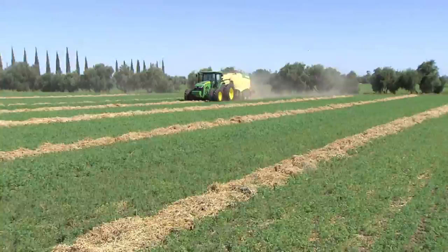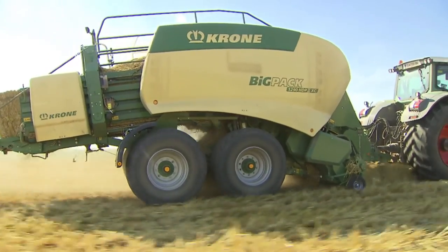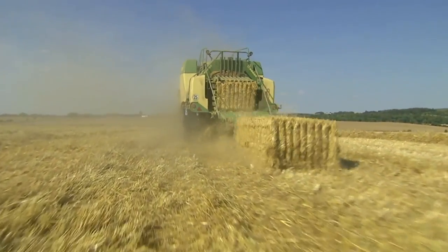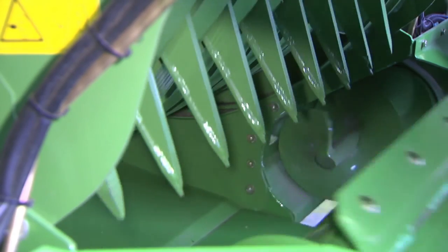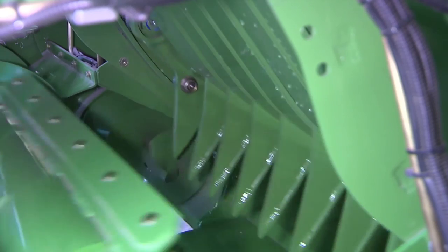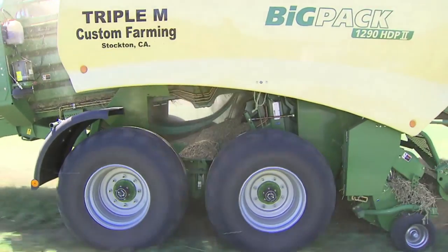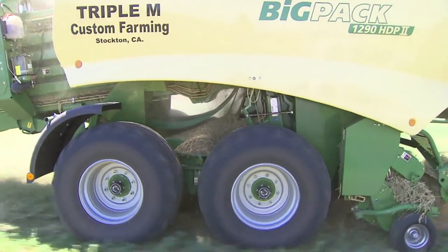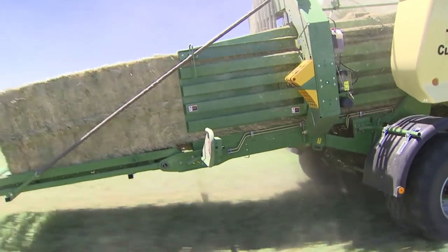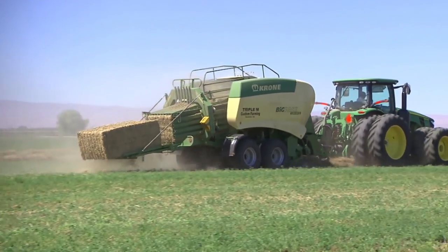At slow or fast forward speeds, in high or low yielding crops, in large or narrow swathes, the variable VFS filling system ensures the bale chamber is always filled to capacity and leads to consistently dense bales. Inside the BigPak high-speed feed chamber, four packer rakes and one feeder rake pack feed the material into the baling chamber. Initially a retainer collects and retains the crop until the feed chamber is filled sufficiently, then the feeder rake feeds it into the baling chamber. VFS ensures that consistently sized parcels of material are fed into the baling chamber, so the baling chamber is always filled with consistent volumes of crop, irrespective of the swathe size.